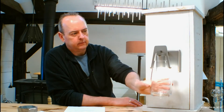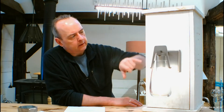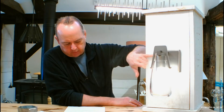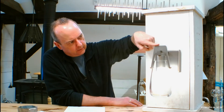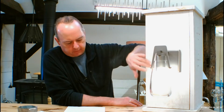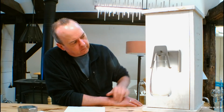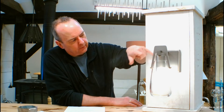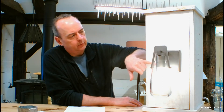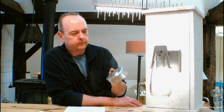Cannot hang upside down because it's kind of hanging like that as you can see. This is 10.8 inches tall — from here to the bottom of the glass. 5 inches wide, and that's the width of the back plate — the back plate is 5x5. Projection out is 6.9 inches. On the other side is a universal mounting bracket that'll go on your 4 inch J-box junction box, and it'll also go on a gang box without a problem.